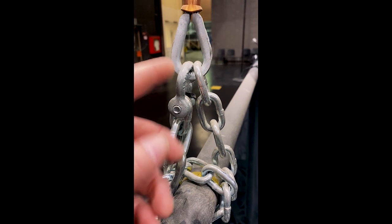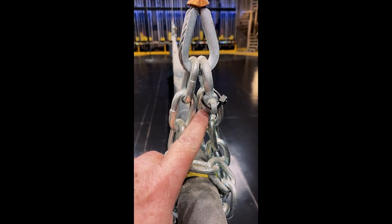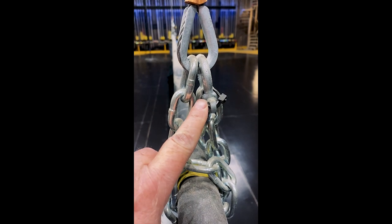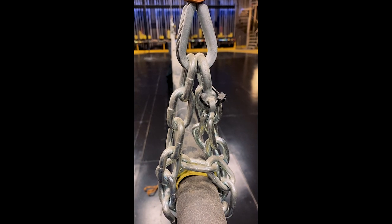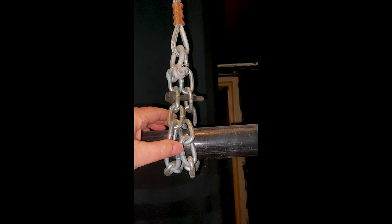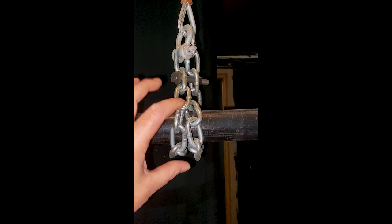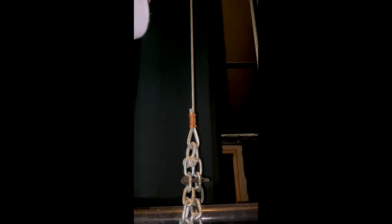You can do the shackle pin up or pin down, whichever works best. I think this size shackle doesn't fit well through the quarter-inch chain. For a long-term installation, don't use a zip tie as mousing because zip ties can deteriorate over time with heat and become brittle and break, whereas wire mousing does not. The disadvantage of the chain wrap is that if you're near the end of the pipe, you risk the chain wrap walking. The advantage is that I can quickly adjust it left or right to get my vertical cable drop 100% perpendicular with the loft block above.